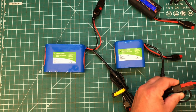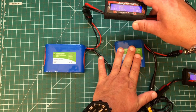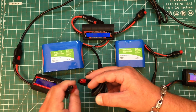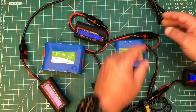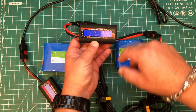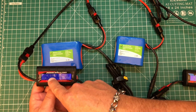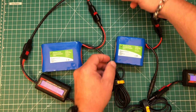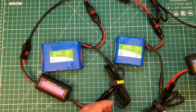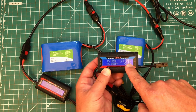Battery B is at about 13.17 volts. I have a couple of PowerPole-to-banana plug adapters. I'm going to connect the charging cable and barrel connector — that'll show us the voltage for battery B. I'm placing an inline watt meter between the two batteries to monitor current flow between battery A and battery B. This watt meter from our charger will connect to the PowerPoles, which is this barrel input.